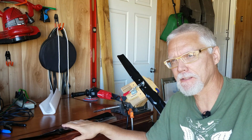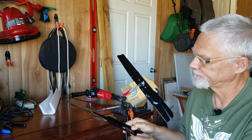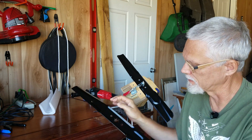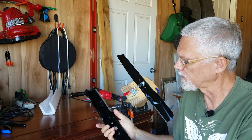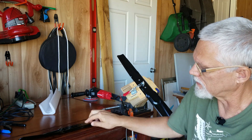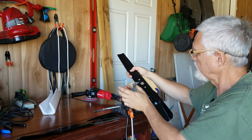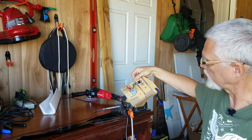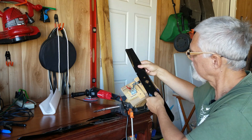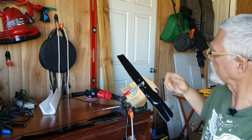The blades I have — I don't like them because of this: it just looks like it's been swagged all the way into the blade, apparently to make it stronger somehow. That just makes it so when you put it on the table it wobbles all over the place. That is why I put in this wood piece that fits flat up against the bottom of the blade. Where I've got the clamp it seems to hold it in a good spot, so that's where I'm going to leave it.